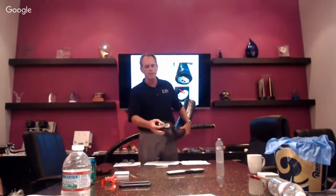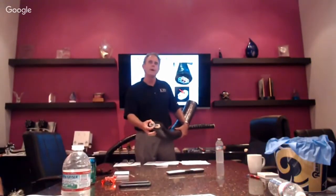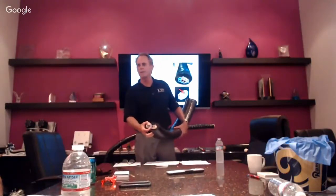So to illustrate that, here's a double wrap. So everything up to 12 flavors on Perlick, you get 2 copper lines. When you go beyond that, you get a double wrap. So you've got 2 sets of copper lines, but you can just see how every beer line is taped and touching a copper line. And it's that way all the way up through the base of the tower, into the cooling block, and the shank that the faucet goes into is touching the cooling block. That's why the Perlick faucets are always sweating, because they're cold. And where moist air meets cold, it sweats. It's just laws of nature, not Perlick nature, but.